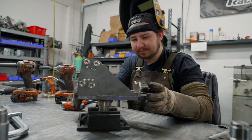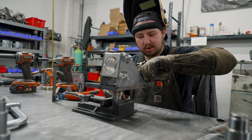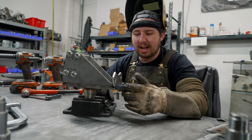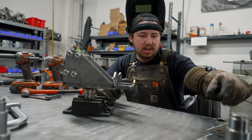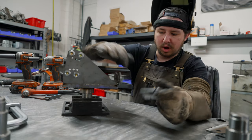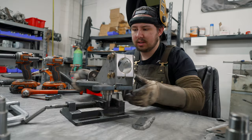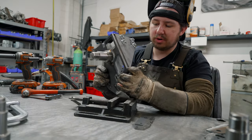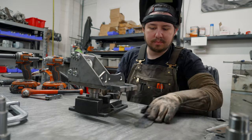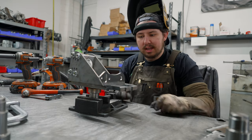Make sure it's all going to fit. All right, nice and square — we're going to put our first double shear plate on, our top plate. Now that we've got this assembly tacked up, we'll start to weld everything out. The only thing we're missing is the bottom shear plate, but it's much easier to get in here and weld this little fillet out first — get all the heat into the plate. We'll do an open-corner-style lap joint fillet here, weld this first, then clean it up, throw the bottom shear plate on, weld it inside and outside, and then we've got ourselves a knuckle.